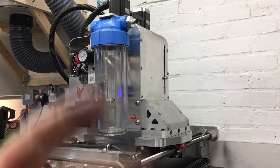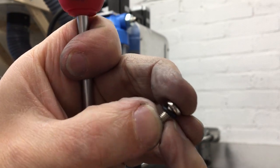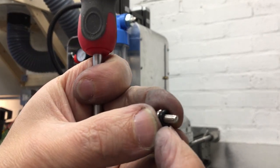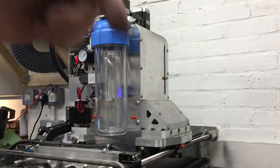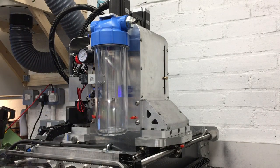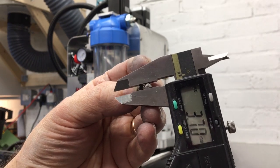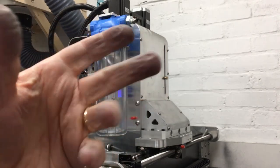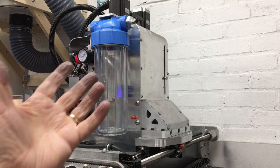I couldn't wait - I've just literally taken it out. The screw does have a proper thread in there, probably a moulded insert, and it has a little O-ring on it, so it's obviously meant to have a pressure seal - which means it's either for an auxiliary pipe or a safety valve. It's probably M4. So is there such a thing as an M4 safety valve that I can set to maybe 30 or 40 PSI, just so I don't explode this? If you've got any comments, let me know.